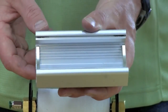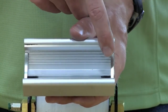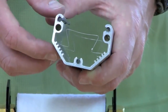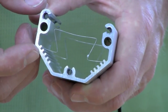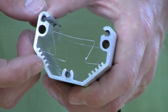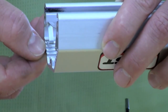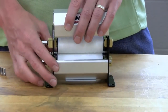Before reinstalling the upper extrusion, verify that a flat spring is installed on each end of the extrusion. These flat springs apply pressure to the rollers to keep them together during operation. Also verify that both ends of the flat spring are in the same relative extrusion groove. These different grooves allow you to change the amount of pressure on the rollers — it is important that both springs be positioned in the same grooves. Also be sure that the springs are positioned about 60 thousandths from the end of the extrusion, which allows the springs to clear any interferences on the end plates.